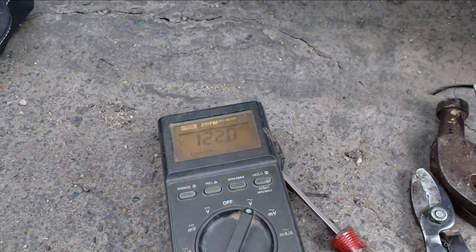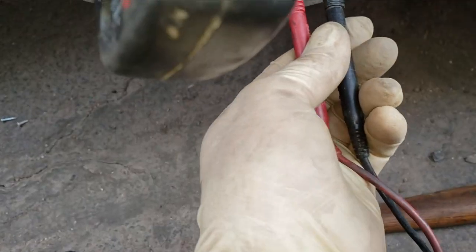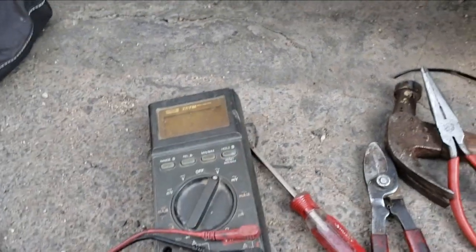All right, so 240 there, 240. How about 120 and 120 there? All right, let's go turn this AC on. Now, I may not have explained it, but this is a basement AC that only the second stage was working because the first stage had a leak in it. And that's what we found at the top of the condenser right there. And hopefully we fixed it.